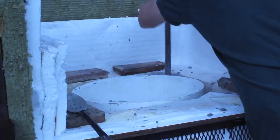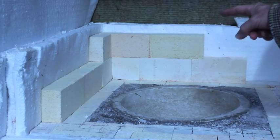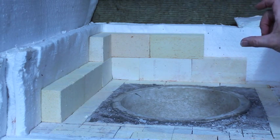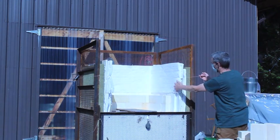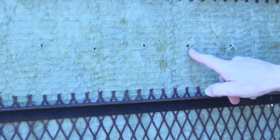I've got the investment poured and I'm starting to place the upper chamber bricks. The K23s go on the outside and they're vertical, and the K26s will go on the inside of that and be horizontal. I've run the upper chamber bricks up as far as I can right now, piloted in the holes for the elements on the outer row of bricks, and I can now place the inner row and transfer the pilot marks to them.